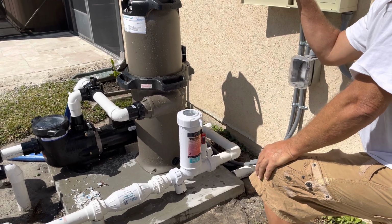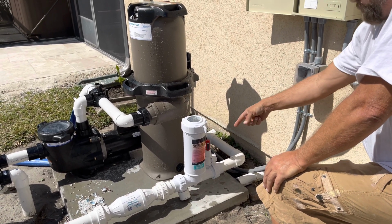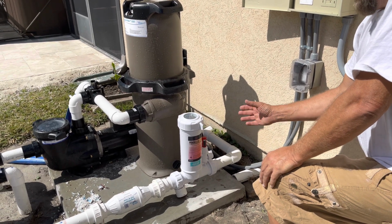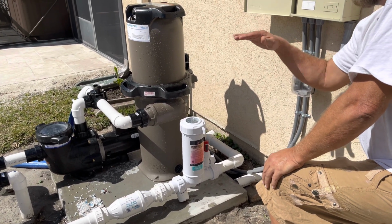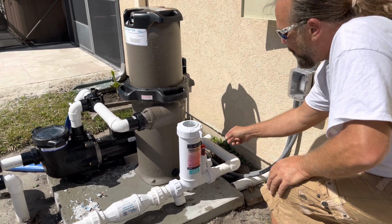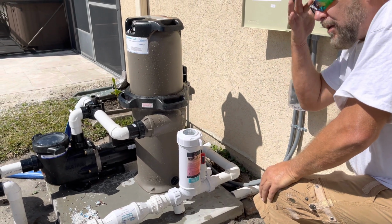The reason is you do want our chlorine residual to catch hold. Right now it's probably not caught yet. That's why we're still wide open, putting chlorine in the pool as fast as we can to keep it crystal clear and blue. But eventually, you're gonna learn a little bit more in a minute, it's gonna catch a hold. It's called chlorine residual, and once it kind of catches a hold, then you're gonna start lowering this guy. Cool?